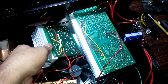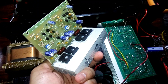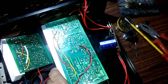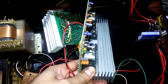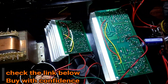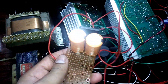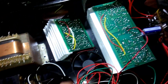I'm going to use one kit — close to 200 watts — for my Sony subwoofer. And this kit is a bigger one, around 500 watts RMS, and I'm going to use this for a 15-inch subwoofer. This is one bridge rectifier kit, and I'm going to add two more capacitors here for the bigger amplifier.